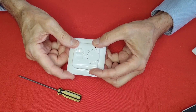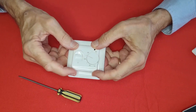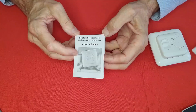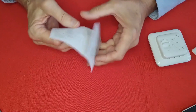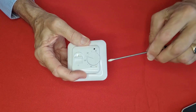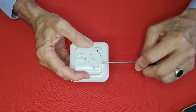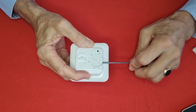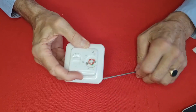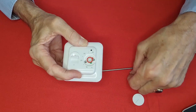On unwrapping the thermostat, my first puzzle was how to open the M5 to get at the fixing screws — there's no mention of it in the instructions. What you have to do is carefully insert a screwdriver under the adjusting knob and very gently prise upwards until the knob comes free. Simple once you know how.